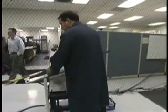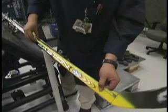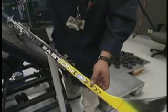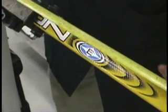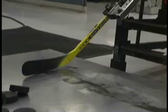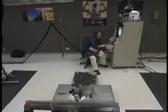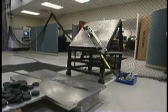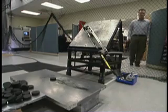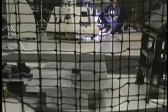A test we have in place that really helps us gauge the playability or play strength of a stick is what is affectionately referred to as a Robotsky. It's basically a dynamic puck shooting machine where the stick is attached to it and an arm swings the stick at 100 miles an hour, whereby we test the overall strength, flex, torque, and basic durability of the product before we put it out to market. In creating this test, what we really wanted to do was attempt to replicate the dynamics of a stick on the ice as much as possible, meaning a preload of certain inches and a strike point at a certain point. As you can see, the arm of this machine is swinging at 100 miles an hour, which means the stick is going along with it. Just to put it in perspective, there really aren't too many hockey players — none actually — that can swing at that rate. I don't believe there are any human beings that can swing at that rate.